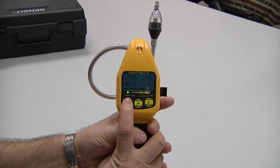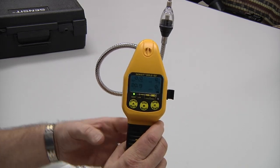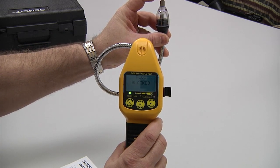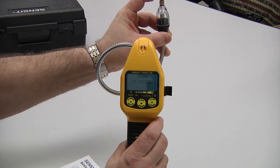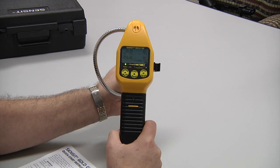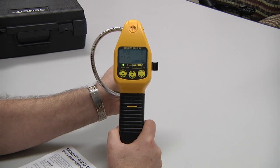To exit the tick test, press the A button one time. Prior to any entry within an area, press and hold the gooseneck assembly to show a flow block indication, which does indicate whether the sampling system is working correctly. Other display indications in this instrument include NSR and NSC.